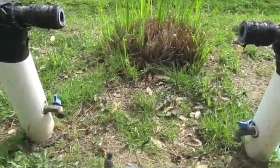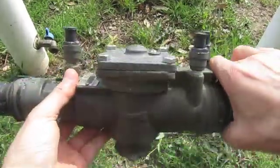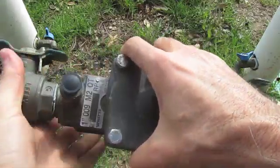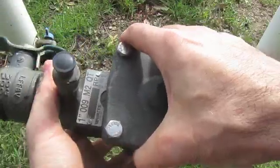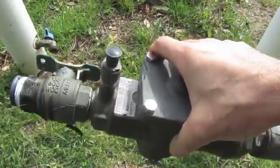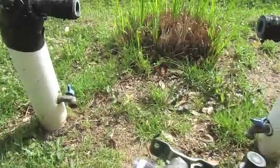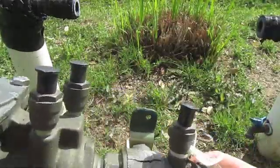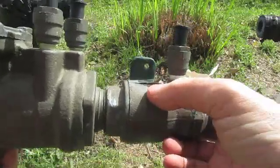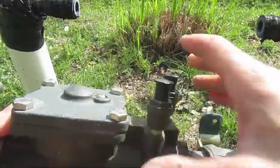You can see where I cut it out right there. I tried draining - I drained this last season. This is a Watts model. I've also tried putting little drain spigots on each side, but look where mine cracked even after all that prevention - right here in the ball valve.